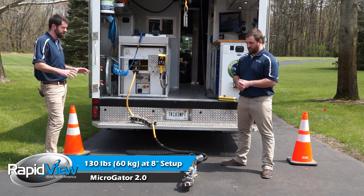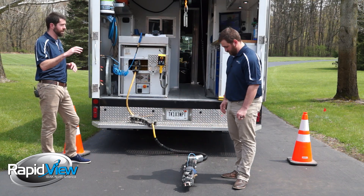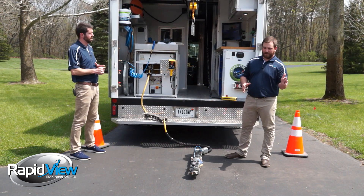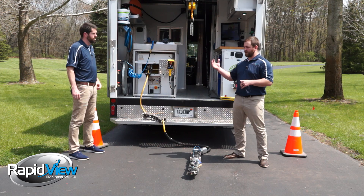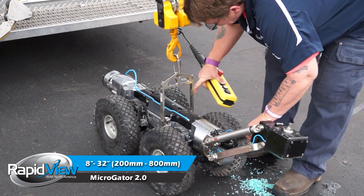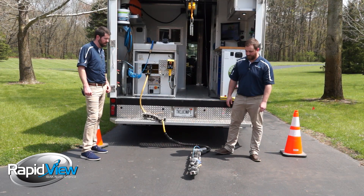As far as the 8-inch setup — oftentimes we get jobs requiring cuts in 24-inch or 30-inch lines. How high can we beef up this one tractor, or do we have to buy another tractor for bigger diameters? The Micro Gator can operate from 8-inch pipe up to 32-inch, and it's just one cutter. We utilize a height attachment carriage where you drop the body of the cutter into that carriage and you're instantly ready for 32-inch pipe. We have extensions for the cutter bits to reach those larger diameters — 8-inch to 32, one tractor.